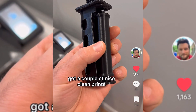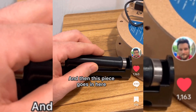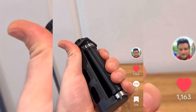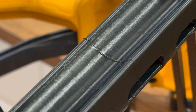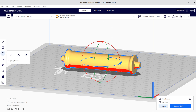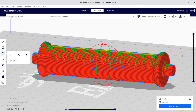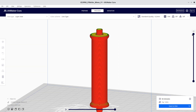Sharing my recently 3D printed spool roller on TikTok sparked some interesting feedback about print orientation. A universally accepted tip for all 3D printing enthusiasts is that layer lines are one of the weak spots of the print, meaning it's best to rotate your print so that the layer lines are being compressed when force is applied, opposed to that force working to break the layer lines apart.